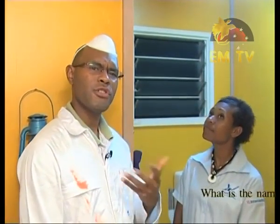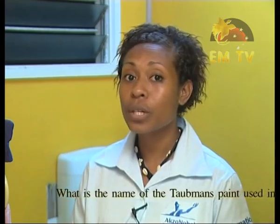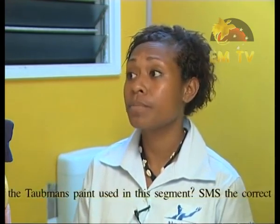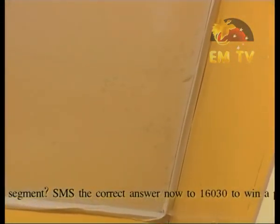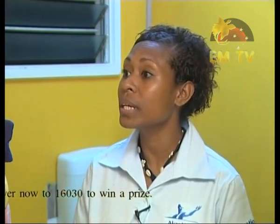Well, Tidman, the first thing we have to do here is prep the surface. And with mold, we have to do it a bit differently. Vavine, I thought you would just wash the ceiling with sugar soap. That is why you have me here, Tidman. The sugar soap will not kill the mold spores. It may wash away the blackest marks, but the mold spores will still be there. So we need to clean it with a mix of bleach and water. That way it ensures that we kill the mold before we start painting.